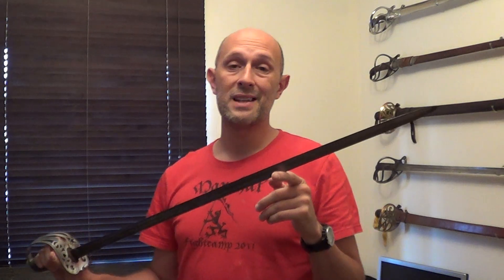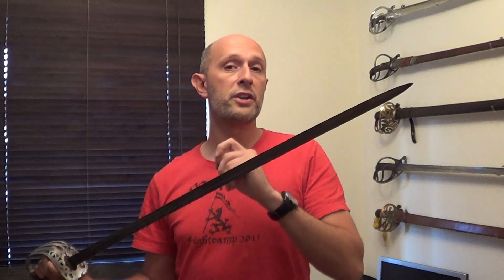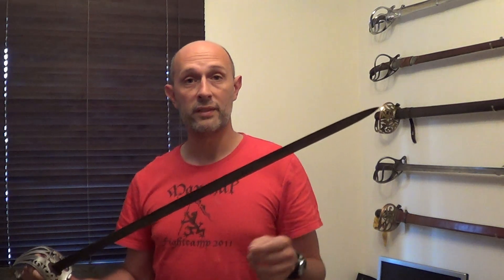Not all swords are made like that. A famous example is the katana, the Japanese sword, which is in fact only hardened at the edge. It is not hardened and tempered in the way that European swords are, or indeed most African and most other Asian swords. It is simply only quenched at the edge — the back of the blade is soft. So if you take a traditionally made Japanese katana and put your foot on it and step down on it, you will bend it and it will stay bent, because the majority of the blade is essentially soft, un-heat-treated steel. Only the edge is really heat-treated. So it will bend and stay bent, much like a Bronze Age sword.